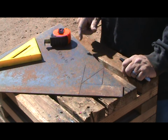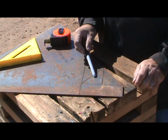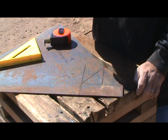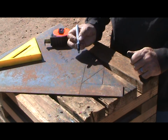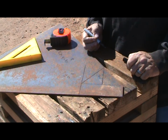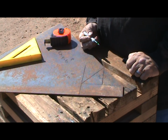Well, we're in luck. Found a good bit of 1/8 inch plate that we are using for the trommel back in the scrap pile. So I've cut out a little piece, 5 3/4 is the width from the end of one angle iron to the other. So I'll be able to weld these there, and then this will be extended out. And of course, all this will be rounded off and cleaned up, and then we'll put our hole, whether it be for the pin hitch or the 1 7/8 ball hitch. But anyway, we're going to get this cut out right now, and then we'll clean everything up and worry about getting some welding done, and then it's going to be a matter of painting and getting everything set up.